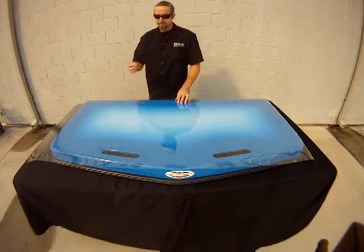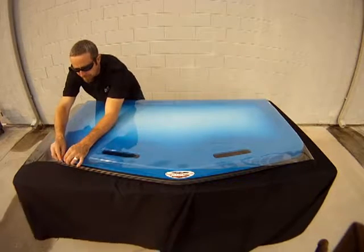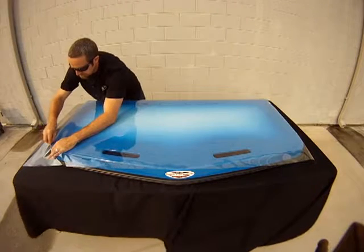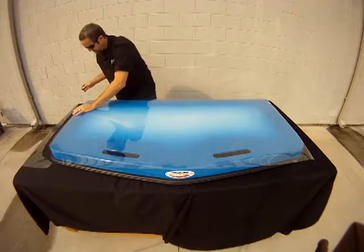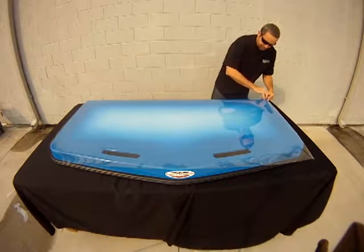The platform used in this video does not have a molded-in non-skid pattern — it just has a smooth gel coat surface. So with the permanent marker, I will carefully trace the outside edge and handhold cutouts. When a molded-in pattern is present, you should trace the outside edge of that molded-in pattern as well.